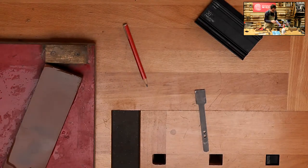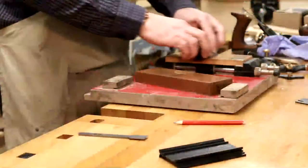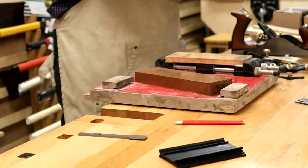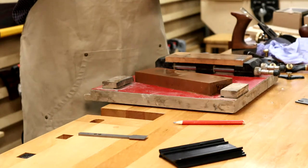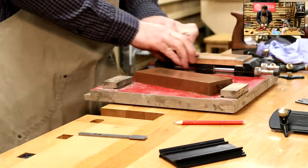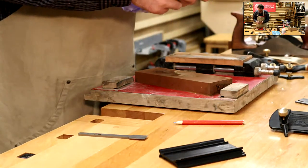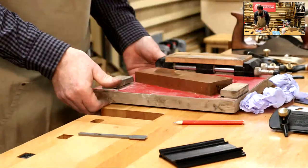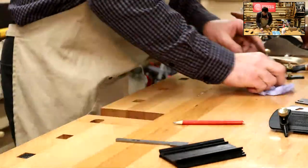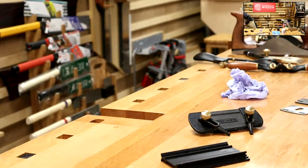That's good to do. I need to wipe off the residue. I don't want to contaminate the other stone. 6,000 grit, back and forwards. Again, it's all about making it repeatable and controllable. Take the blade out. I know I can do that back there. Okay. Not cheap, those. For a second, I'm just going to put the water stones out of the way briefly. Quick clean. We'll put a few tools back together. Put that back over.